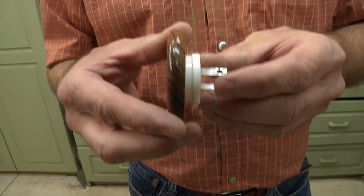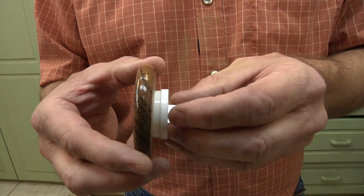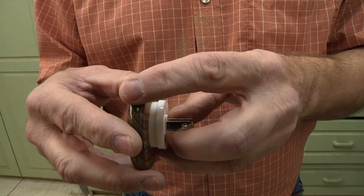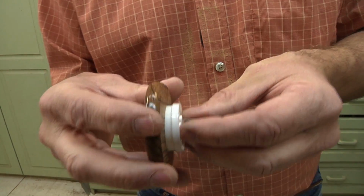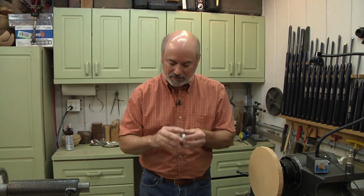And you can see one other thing. This is not a ½ inch. I'm going to take some of the wood off as I turn, but why didn't I go all the way down to here? Well, I found out the hard way. When you make it the entire width to where this slides all the way down to there, you can't get your fingers around the edge to pull it out of the socket. So you don't want to do that. You need a little clearance, so you have a little grab to yank it out of there.